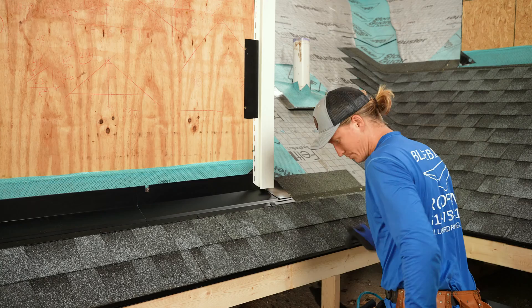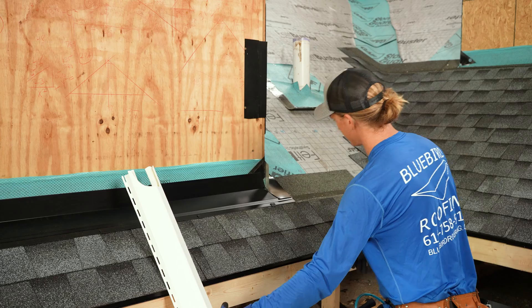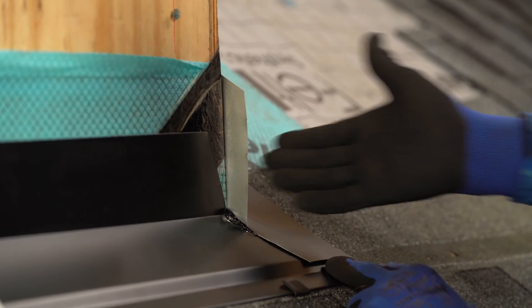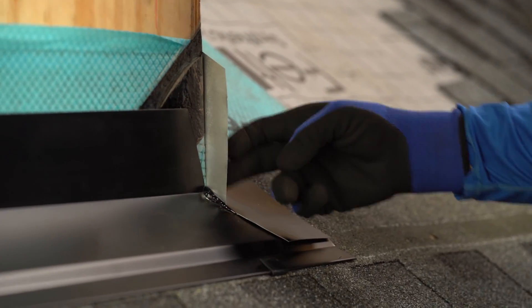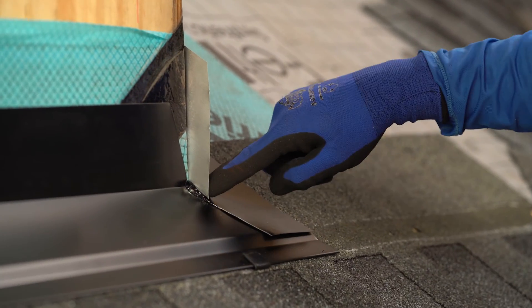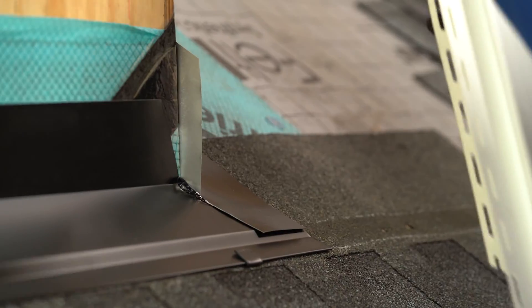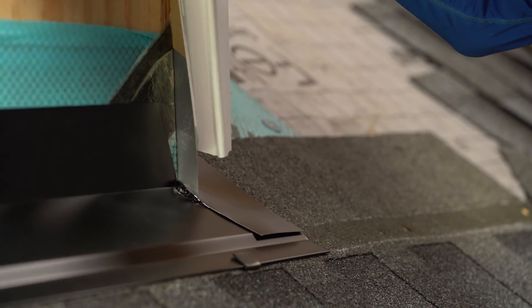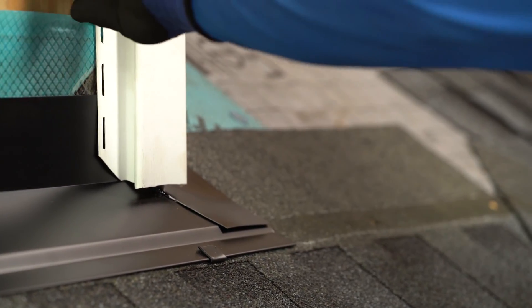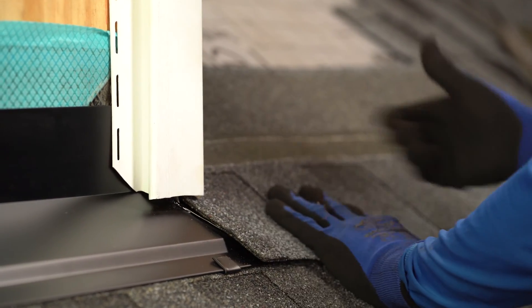I'm going to go ahead and put two nails at the top. I intentionally just put this on so that it could be removed, because I want to show you what it looks like underneath the corner. I installed this with the corner still on, but with the corner off we can see what it looks like — this is excellent. The step flashing extends past the corner that full half inch to three quarter like we need it to. I have caulking underneath the step flashing here. This corner is really well protected, and with the corner on top you can't see anything — very waterproof. And then the shingle is going to go on like this, and that's the finished product.